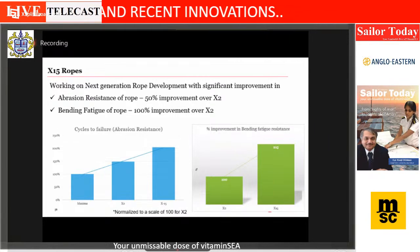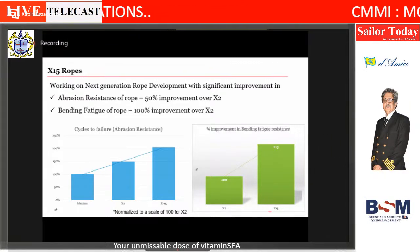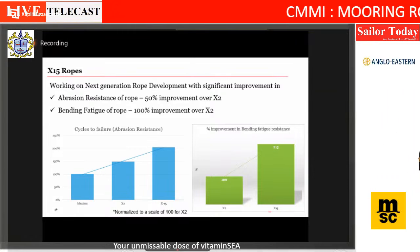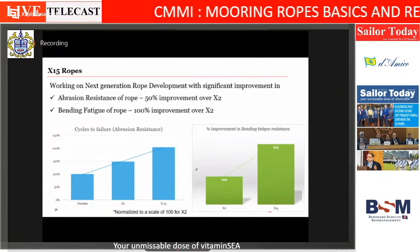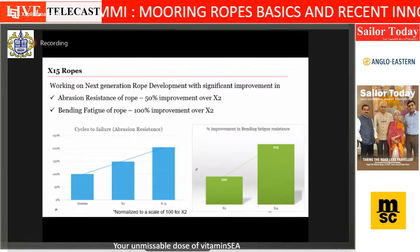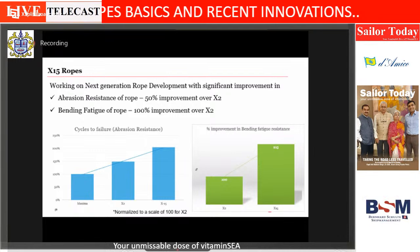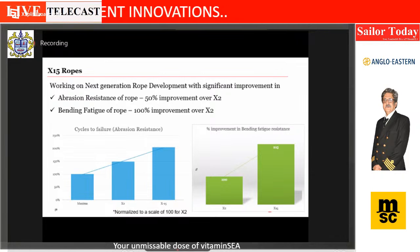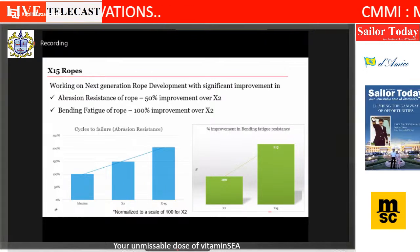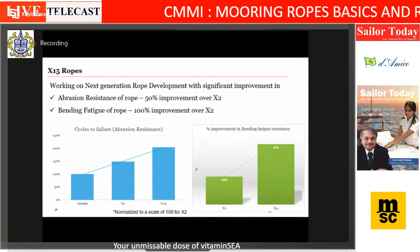So if you are doing this kind of test in the laboratory, I'm also myself a towing surveyor now in Dubai. So I've seen the condition of the equipment on board the vessel matters a lot, and the rope quality. One of the vessels which I recently surveyed about 2 months back failed because she had a chaffing edge on board. So you can imagine, there's already a structure which is going to chafe or cut the rope at a greater weight than the rope strength. So these are the dynamic issues on board, the different loads. How would you do that in the laboratory?